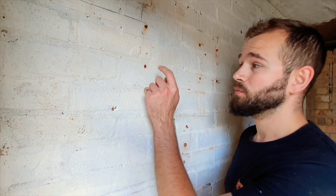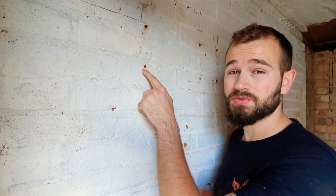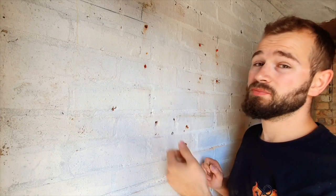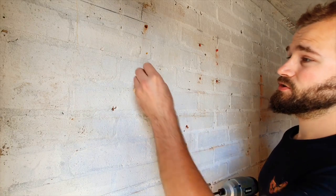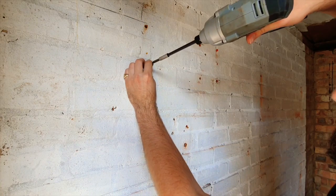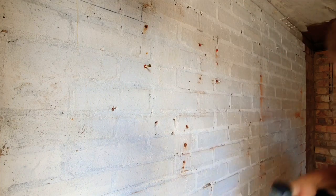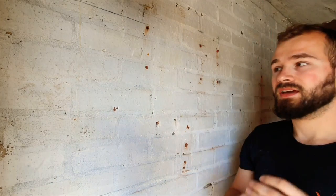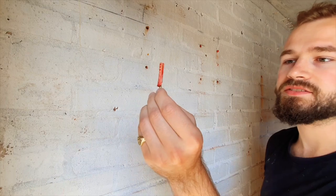Here's a little pearl for you. In walls like this where you've got absolutely hundreds of wall plugs, a really useful little trick for getting these out easily is to use a simple wood screw. These can be an absolute nightmare to try and grip hold of even with pliers, and when you pull them, half the time they either just snap or nothing happens at all. Wood screws are useful because they've got a wider thread. All you need to do is get your screwdriver or impact driver, screw in — only has to be even a couple of mil — then use a normal claw hammer, dig in, and out she comes. Easy as that. Probably turns out that's common knowledge and I'm really behind the times, but whatever.